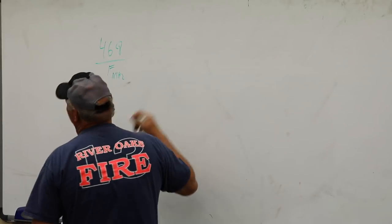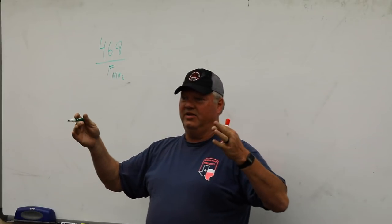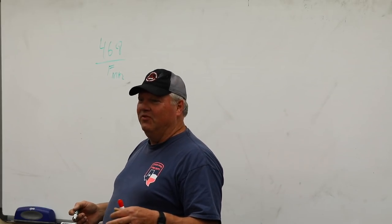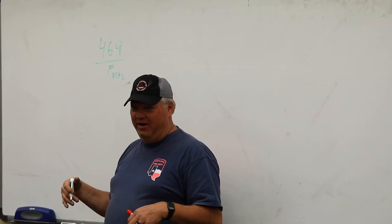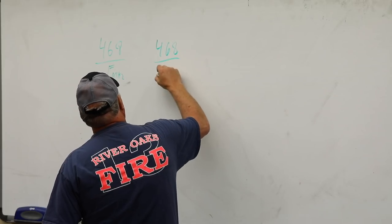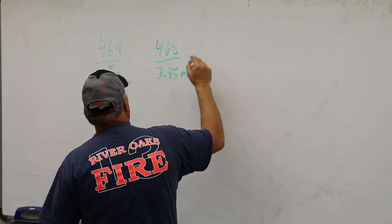So what if we want to talk in the middle of the phone band? So the 80 meters is basically 3.840. So we're at the phone band somewhere around 3.8, 3.84, 3.85, somewhere around there, right? So 3.85. So if we went 468 divided by 3.85, right? So what is that?